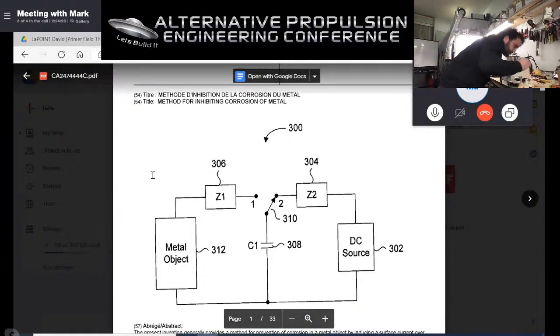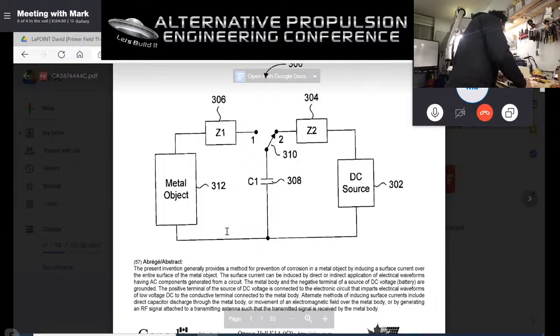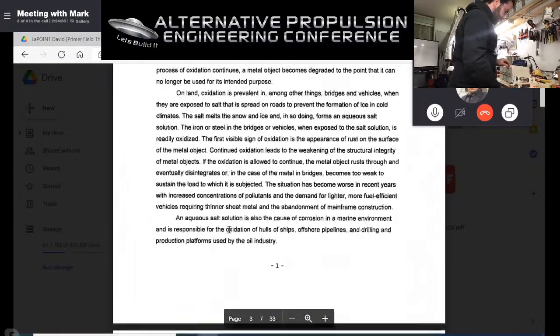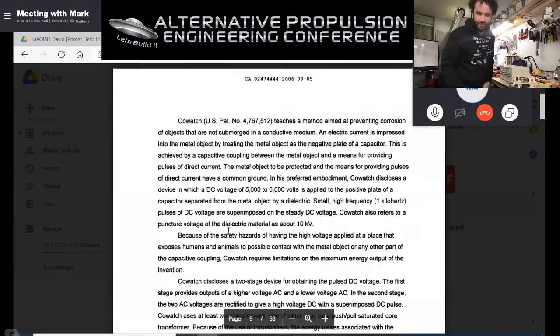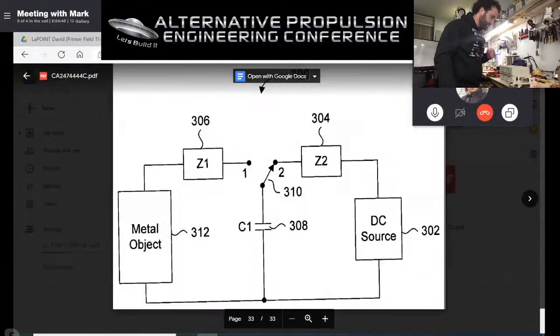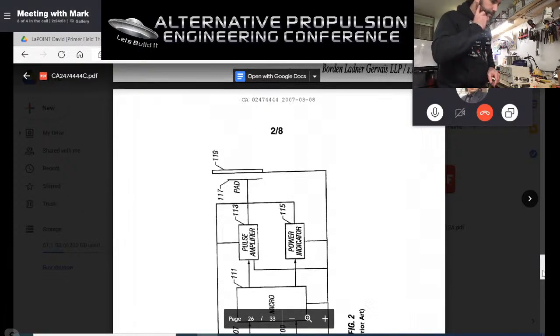Okay, I see glow on one side, I see glow on the other. Okay, so we're glowing. That's good. Good. So it's rectifying then. Yeah, if they're not on, they don't actually block any voltage. Well, they would block everything if they're off. No, it's not actually how it works. You have to have active electron emission in order to suppress current from flowing in the reverse direction. They're more likely to arc over when they're off than when they're on. I'll just leave them on then.